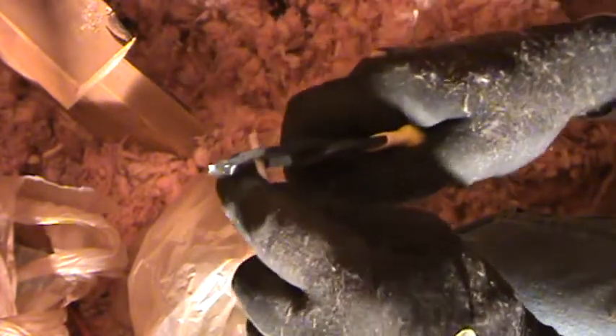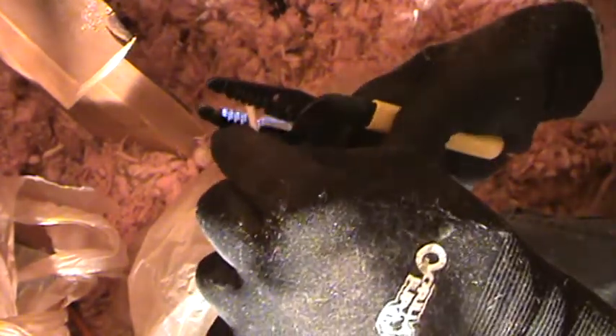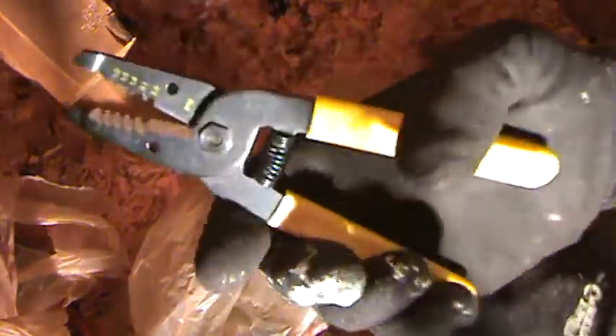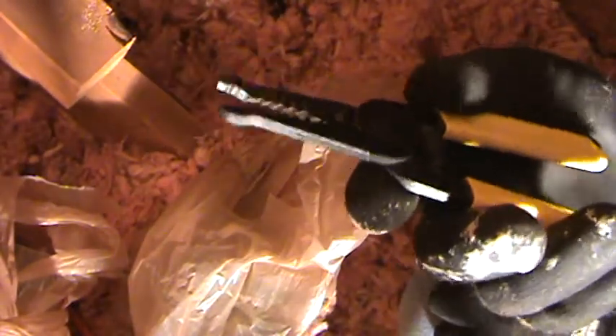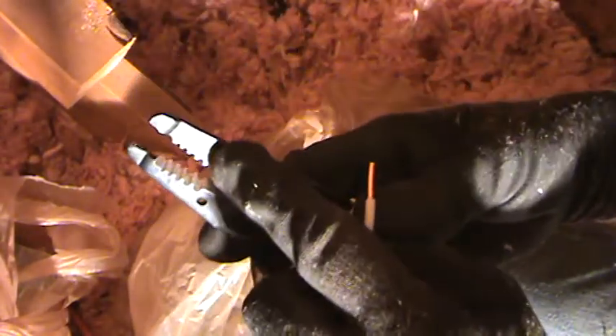I'm going to use this wire as my ground wire. I'm just going to hold it here and strip it back a little bit like that. I'll put a wire nut over that — I'll make it just a hair further, I don't have to do it too much. I'll use wire strippers like this; they work pretty good. There are different holes for different wire gauges — 14, and you look on the side and it will give you numbers. I'm using 12 gauge so you look for number 12.